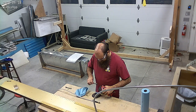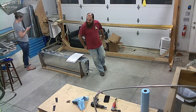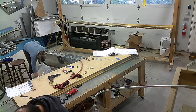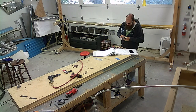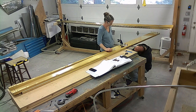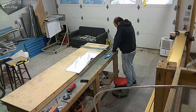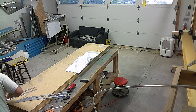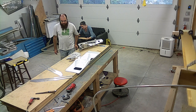It's actually being leak tested right now as we play with the spar a little bit there. We're finally putting the spar - I believe that's the left spar - up on the stand. You can see it's bowed a little bit because it doesn't have any of its structure. It's fairly heavy, maybe 20 to 40 pounds for that spar. There's just a couple of little clecos and ribs and the tie-down spot right there. So a few doodads and a lot of deburring, a lot of fiddly bits - that's the bracket for the wing rear spar that gets deburred.